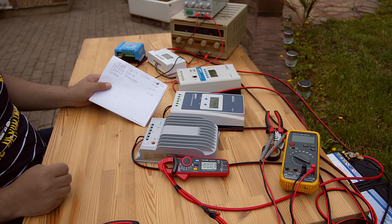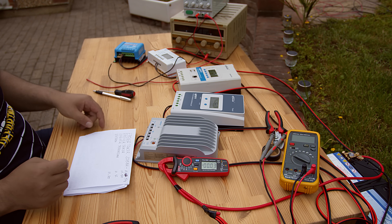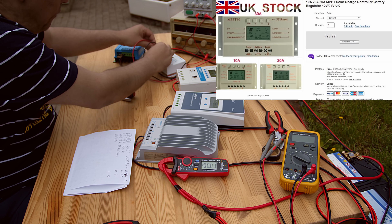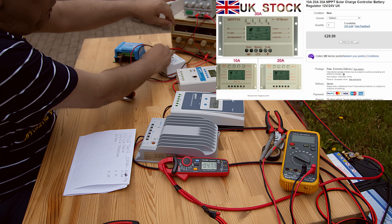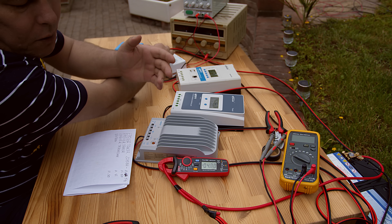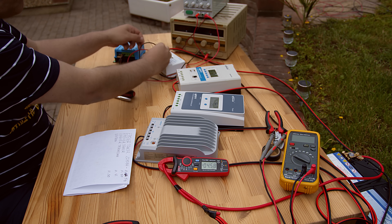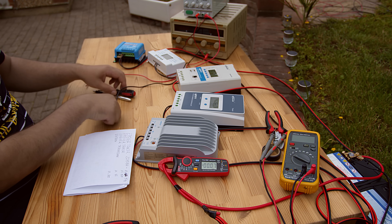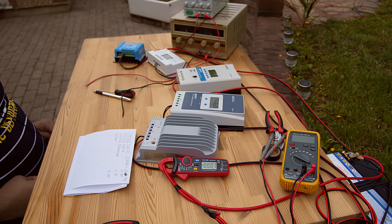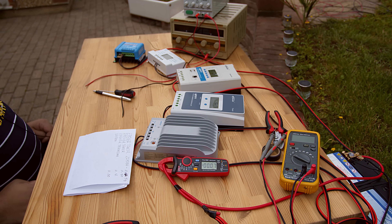You can choose anyone you want. But the cheap one - let me show you. The power supply starts clicking and clicking and clicking and I have there like four amps, so obviously that's not the power point. With the cheap one you get around 50% less from what you can get with a normal MPPT controller - this is not MPPT, this is probably PWM.